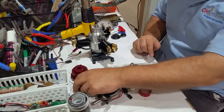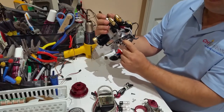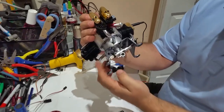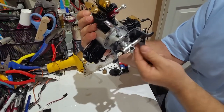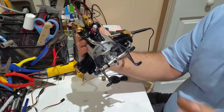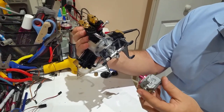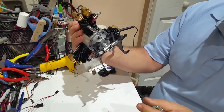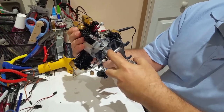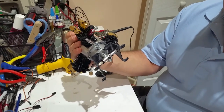Now, for the gasoline, all you got to do, loosen that screw off, take the needle valve off, loosen the 2 set screws here, pull this out, and then you take off the carburetor. Then pull the carb out, insert this one here, put the O-ring from that one in this, stick it in, and that will be one thing.